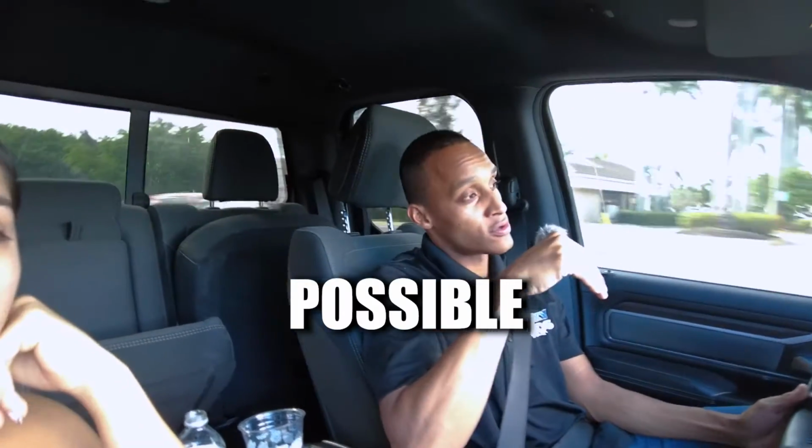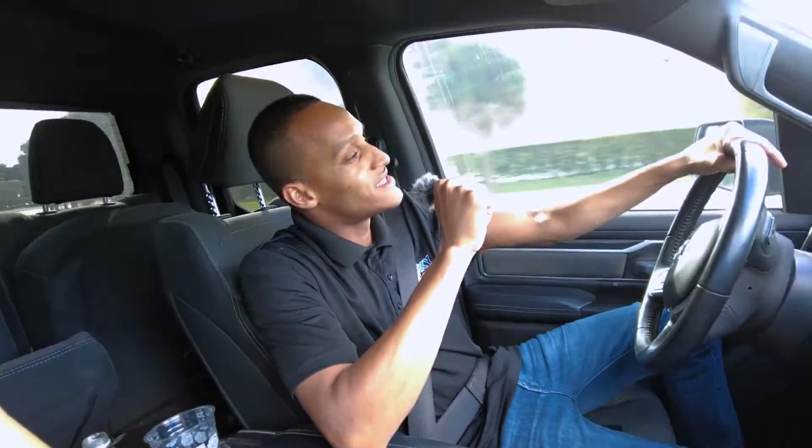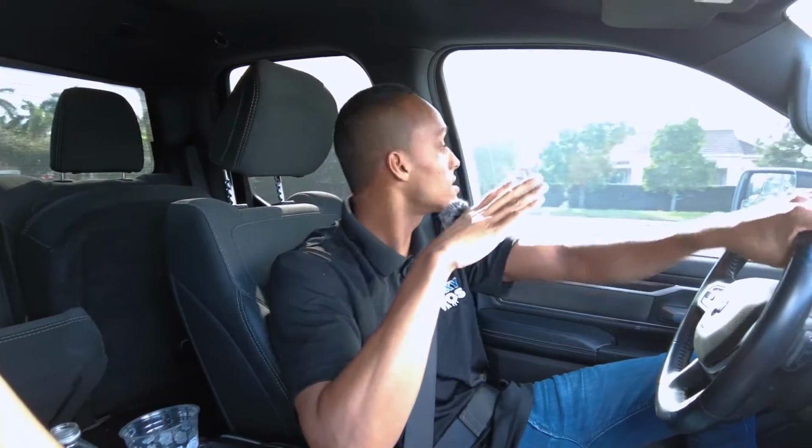Kind of want to budget in that price if possible, a clear epoxy top coat at least, because just doing 2 coats, a base coat and an epoxy decorative coat, there's no room for error, guys. You can't have anything fall into that floor. You can't have any bugs, anything like that get in the floor, because it's almost impossible to touch up. And that's what we're dealing with right now. We really don't want to do an extra coat. We're gonna see what we could do.